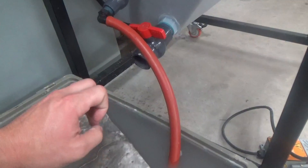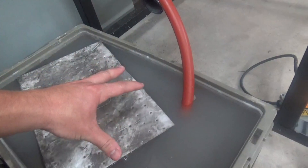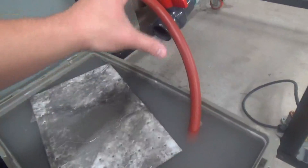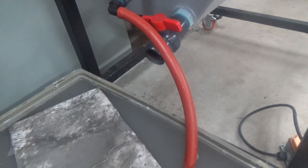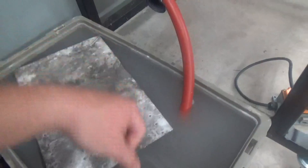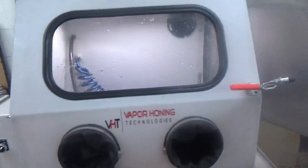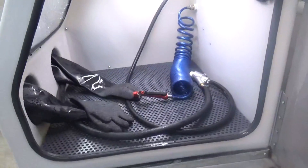The whole point is to do this in four or five different stages. Fill this bin up with abrasive and water, let it settle out, drain it off. Fill it up, let it settle out, drain it off — just keep doing that and you'll be fine. That way you can capture all of the abrasive particles that come out of the machine, let them settle out from the water, dry them out, and dispose of them properly.